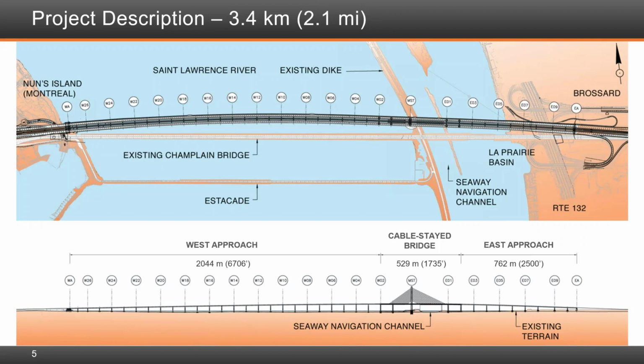Okay. Can you tell us the longitudinal reinforcement ratio in the towers? I don't have that on the top of my head, but it was between 2 to 3%, 2.5 probably. If you're talking about the cast in place. If you're talking about the precast panels, it was very, very small because it was just for thermal, because most of the capacity is the PT.